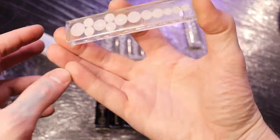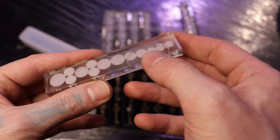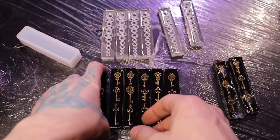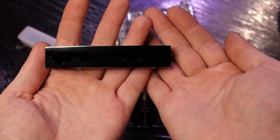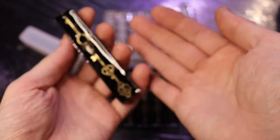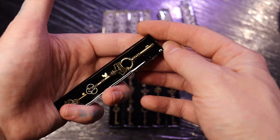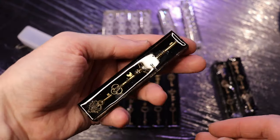Otherwise, sometimes on the bottoms, you can see how there's a little ring right there, where a little resin got underneath our scale. So you gotta watch for that, and you have to sand it to get it flat again. That's what we're gonna do next. We're gonna make sure that everything on the back is nice and flat for when we glue our pick together, and we're going to sand down around the edges here, and sand down a round top and start forming the top of our pick for when we glue it together. And we're actually gonna polish that pretty clean, that way it's ready for gluing and we don't have to screw with it later.